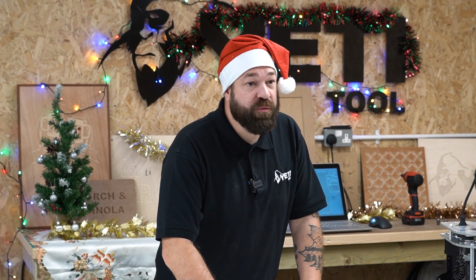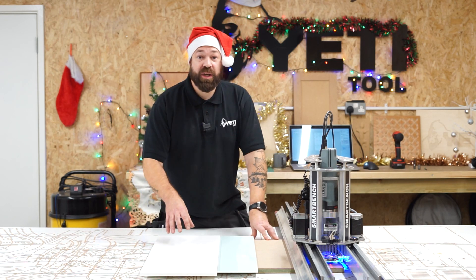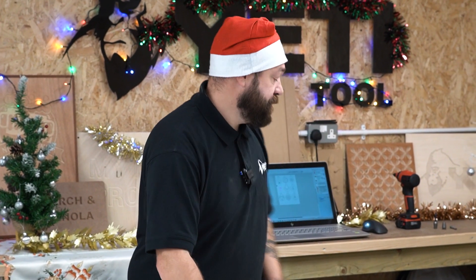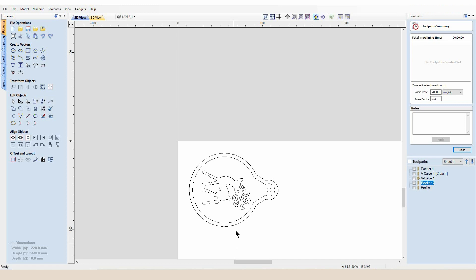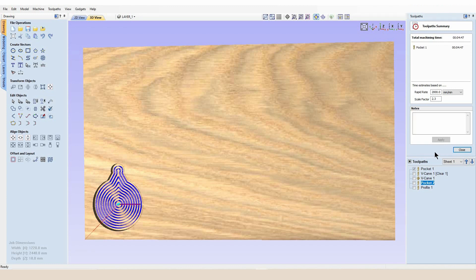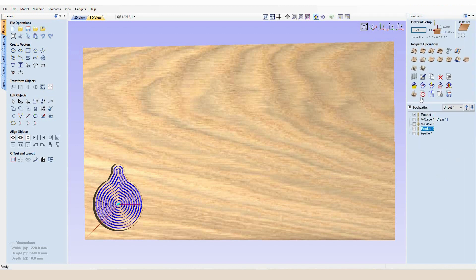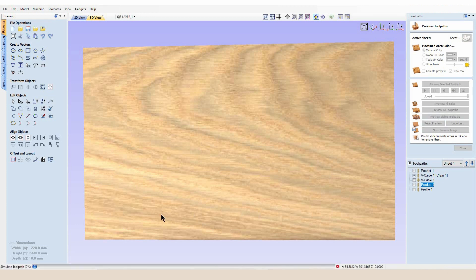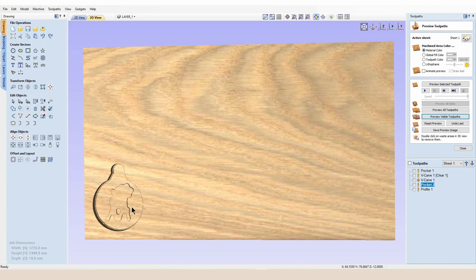If you'd like to make this for yourself, you can follow along to this video. If you'd like to see how we design this, there'll be a link in the description below for a full CAD tutorial. In this video, we're going to give you a brief overview of the files. So this is the file we're going to be cutting today. I'm going to take you into the rendered image, and the first toolpath we're going to be creating is a clearance toolpath so we can take our 18mm stock down to our finished size. I'm going to preview that visible toolpath now so you can see it — clicking the first and second toolpath, then previewing the visible toolpaths. That gives you the 8mm cut straight down to the surface height, and then the 6mm pass creating the clearance ready for our design.